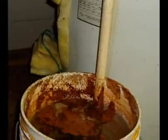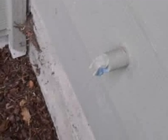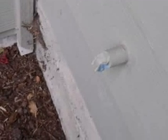These valves have been known to leak on occasion. Here's a TPR drain line that was worked on by a helpful painter. Remove the masking tape, install a 90-degree elbow and an extension of an appropriate length so it points down.